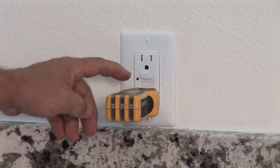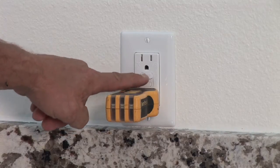Make sure that the power has been turned off at the breaker first. Check the power at the outlet to make sure there is no voltage. Make sure you check between white and black, and black and bare — these are very important parts of it.